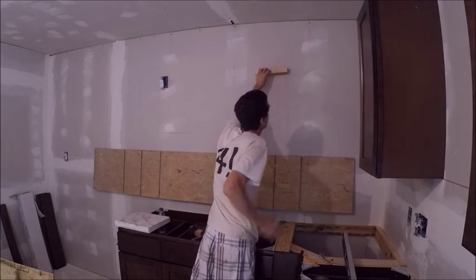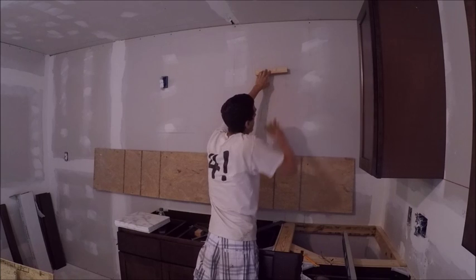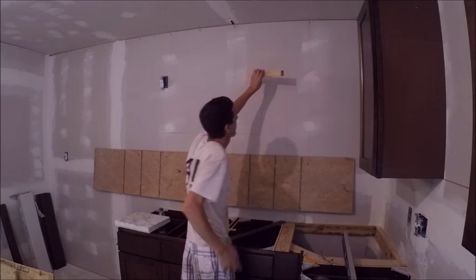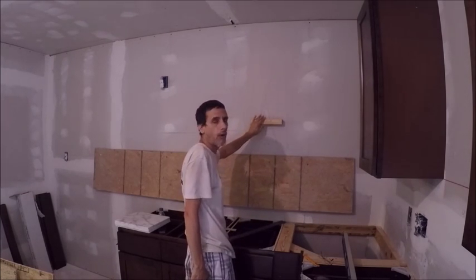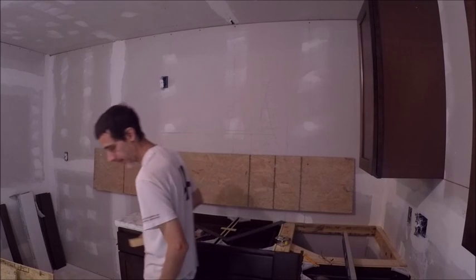And then what I'll do is, I know my 2x4 is here, and I know 2x4 is here. I also know that they're 24 inches apart, so I know how big to make the wood. And then I'll come through with a screw either that direction or that direction, and I'll try to secure a piece of wood here and secure a piece of wood here inside the wall that will allow me to tie this cabinet onto.